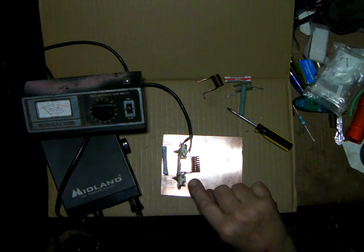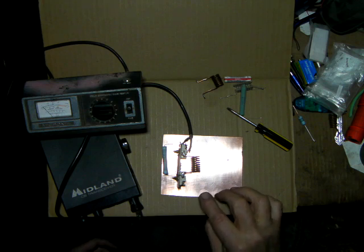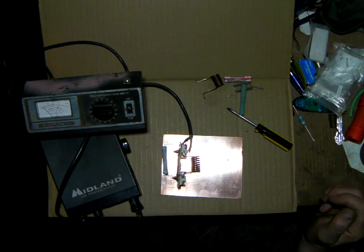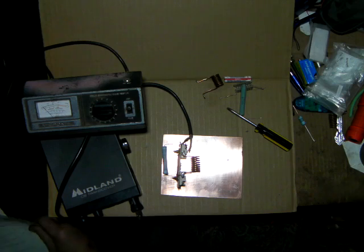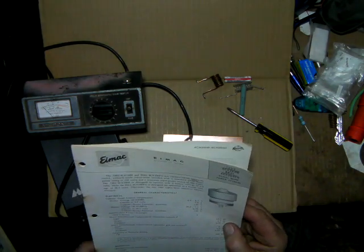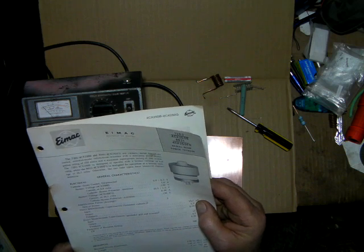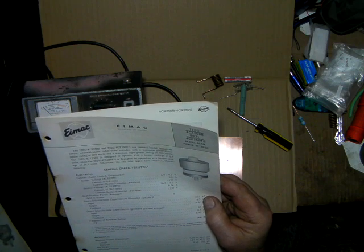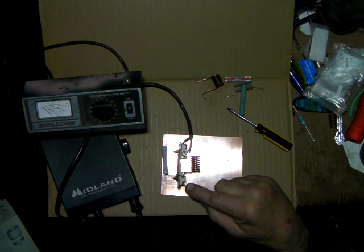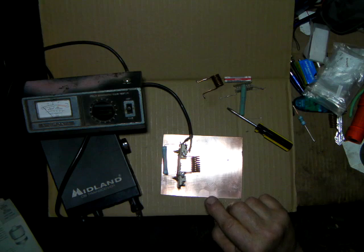Now, the tube end of this will change a little bit once it's connected to the tube. Because if you look in your data sheets, you'll see that the tube has a measured input capacitance on the grid. Let me grab my data sheet here — 15.7 picofarads for the 250B. And that'll be on the grid. So this capacitor will actually need to be backed off just a little bit — you'll need less capacitance to make up for the added capacitance of the tube.